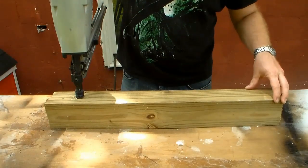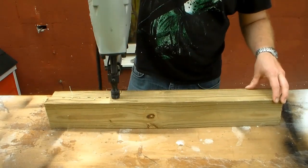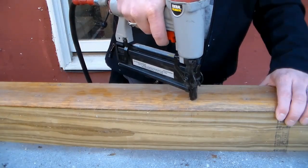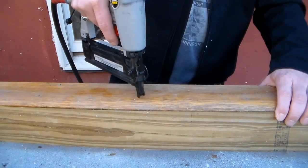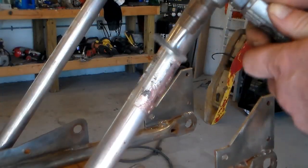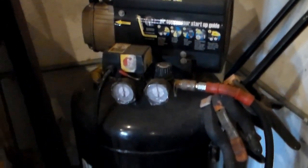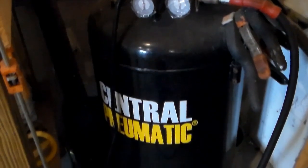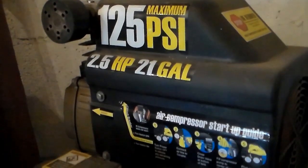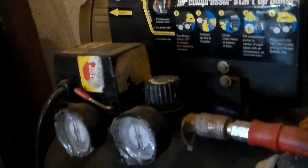Which would be true of any air compressor and any other tool — if it doesn't have enough air pressure, it's not going to work properly. The fact that this compressor struggles to maintain air pressure when using a tool such as this grinder continuously is not something I would consider a strike against this compressor, because tools such as this die grinder use an enormous amount of air, and just about any air compressor, unless it was far larger than this, would have trouble keeping up.